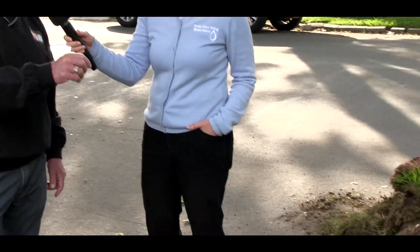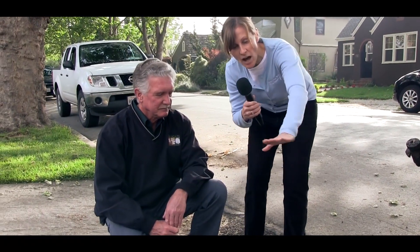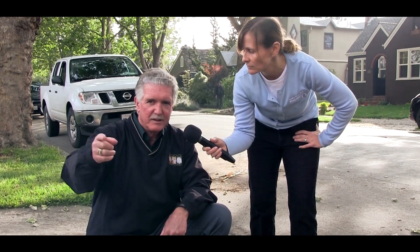One of the things we do is go through and it's recommended to identify by spotting flags onto the head itself ahead of time so you know exactly where those heads are located. In this case we're putting down cobbles, so we're moving the heads and capping them entirely. But in other areas we're replacing them with a drip irrigation system. We'll just cap the existing because it's more cost-effective to put a cap on the irrigation line itself, since we're going to be running a different type of system on the surface. We're abandoning that system, so we don't have to dig out the old pipe and remove it.